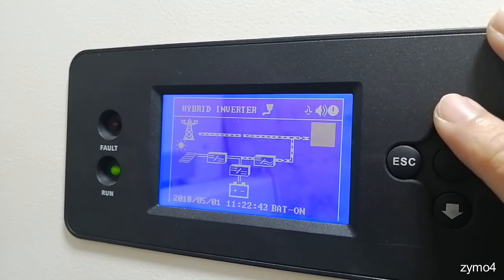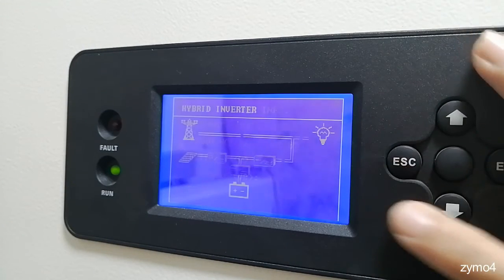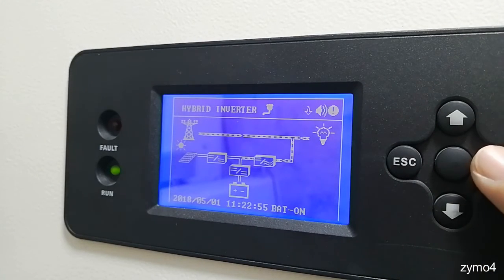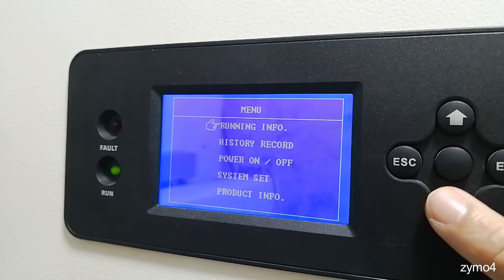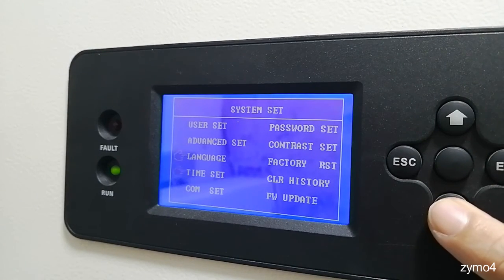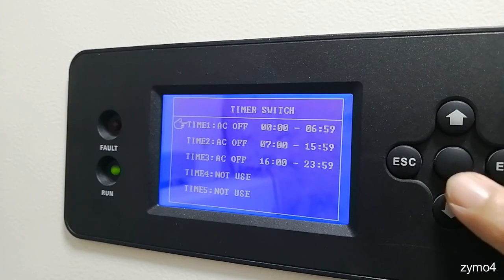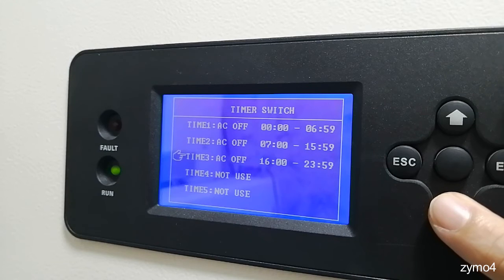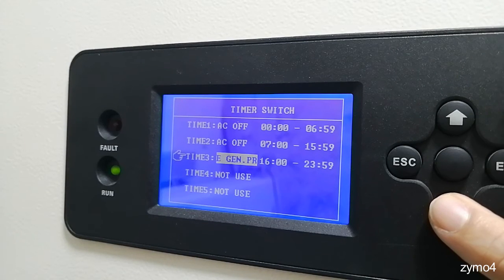Right now we are buying from the grid. To start, let's go back to the settings. The good thing is we don't need to change everything — just change the timer set in the settings. We go to system set, it's all zeros, and then we adjust the timer time set. Previously this was our setting, so we're going to remove everything and reset it to make it work as a UPS.